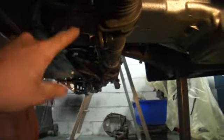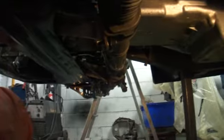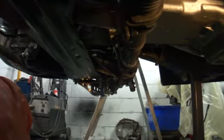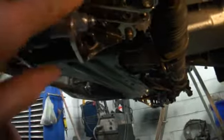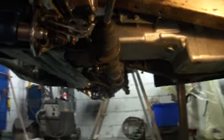It's not too severe I don't think. I've made the brackets out of 5mm stainless steel plate and it's all TIG welded up. I'm going to take them back off and pickle them to get rid of the staining — I didn't polish them like the other brackets for the suspension. But yeah, it's coming on.